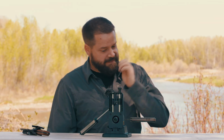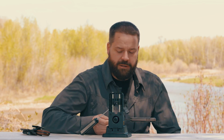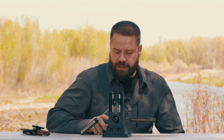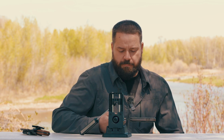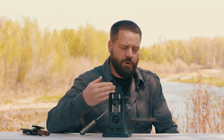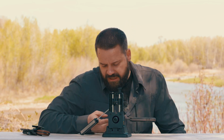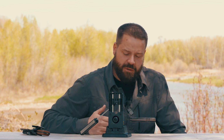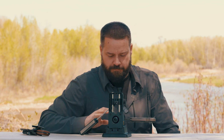And we are reprofiling this edge to an extent. Okay, so this took longer than your normal knife sharpening will probably take because this knife was pretty beat up, and it had a little bit of a chip up near the tip. Now by working a little bit longer, more than the 8 to 10 strokes that are recommended, I did that about 3-4 times on each side. That chip is barely there. It's mainly gone. If we had the rougher grit sharpener, I think we'd be completely done with that.